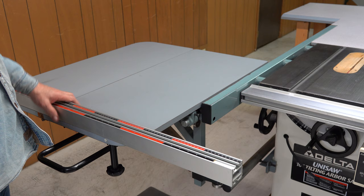Now when you hold these two together, one hand over here, let me grab the camera here, goofy, and now one hand over here, you would do those two hands at the same time, or at least I do. As long as I stay an inch away, I'm happy. With a real shallow cut like this of 5/16 high, you can now create a small piece here that's cut off perfectly at a 90 with no nib. And that's dangerous, so be very careful. Number 56.